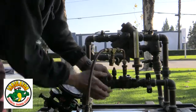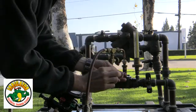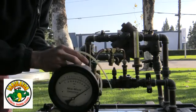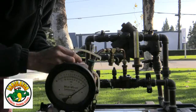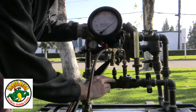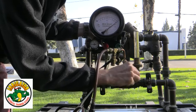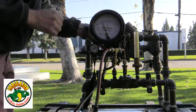Make sure my test cocks are off — they are. I'm going to re-energize the system by slowly opening shutoff valve number one. Then I open test cock number three, indicated by my gauge maxing out at the 15 psi differential. I open my high side bleed, then close that off. Hold my gauge at the appropriate level — center of the gauge at the level of the water; this is very important. I isolate by shutting shutoff valve number one, then open test cock number four with the sight tube. As my gauge goes down, fully open, and observe my reading.